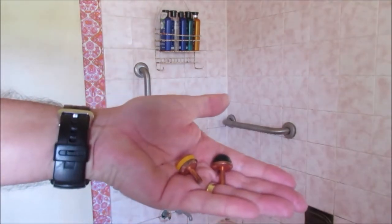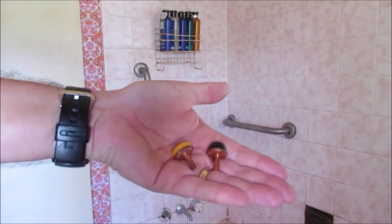Quite often there are maintenance jobs to be done and one of them is leaking taps. For this shower, we've been trying to fix it for a little while now. I've replaced a couple of washers and tried both sorts with no luck. After replacing the washers it might fix for a short period, so I did the reaming out - basically cleaning where the seat is. But there's one thick groove I just can't clean out, so a new washer after cleaning might only work for a short time. The last time I did it was a couple of days ago - it worked fine for a few days, didn't leak, and then all of a sudden it's dripping like crazy. For me that hasn't worked.